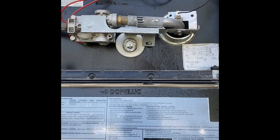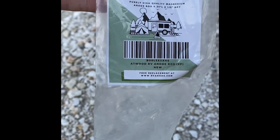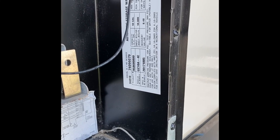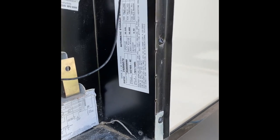Last time I ordered it I got two of them so I had a backup. We're not having any issues with it, just want to change it. This is the actual part — it's an Atwood water heater anode rod. It's a four-and-a-quarter inch length and half-inch diameter. If you don't know what size you need, even if it's not an Atwood, your water heater will have a model number and serial number on it. Mine says GC10A-4E, so it's a gas combination 10-gallon and electric.